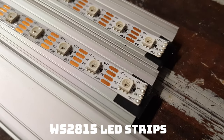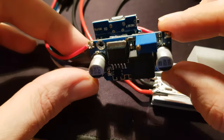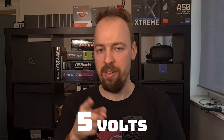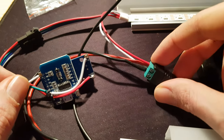Then I tested the LED diffusers. For this I glued WS2815 LED strips onto the aluminum back. These LED strips have redundant data pins and run with 12V, which is great for higher power applications like this one. Then I added a Wemos D1 Mini. As the whole system runs with 12V, I had to use a step-down converter, which I glued directly onto the microcontroller and soldered the wires to it, since the microcontroller runs on 5V. This yielded a nice compact package. Afterwards I connected the LEDs to pin D4, and as input I used a standard 5.5mm barrel jack connector.